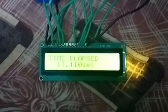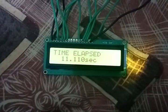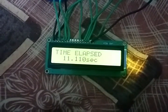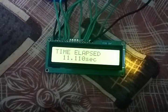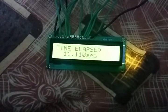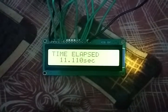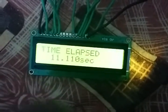This is actually a very basic thing — you can directly download it from the Arduino playground. However, the program you may find on Arduino playground is designed to show outputs on the computer screen. Wherever you find outputs on the computer screen, you have to shift them to the LCD, and you may also have to use a lot of setCursor settings and other inputs to get a decent output like this.